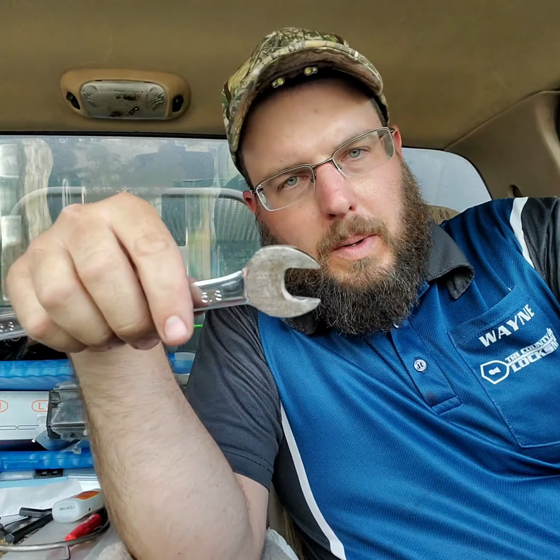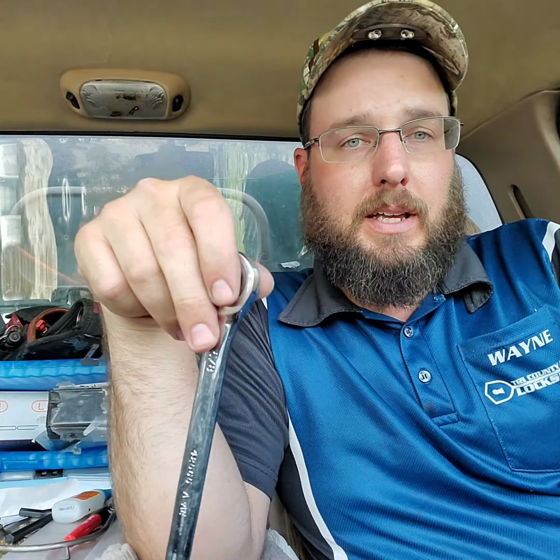I adjusted the door without having to pull the door. Still charged the same because it's a door adjustment, but just because I can figure out how to get it done alone in 5 minutes doesn't mean that a glass company wouldn't have come out here and charged who knows how much. It would have charged for two guys to come out, or one guy to drop the door, release the pivot, fight with it, spray it with a bunch of lube, and so on. Anyways, my way is put an airbag up under it, lift the door up,